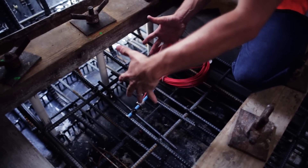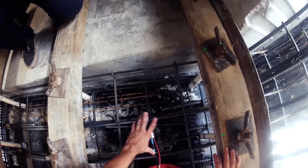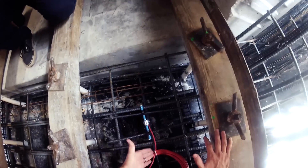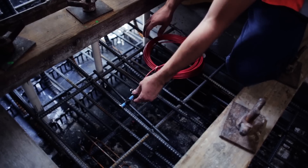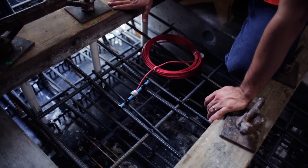I think this technique is more useful because you can actually know the shrinkage and the creep within the structure. So as the concrete shrinks or creeps, it'll push in on the sensors here on the end, compress it, and it'll get conducted through the cable, and it'll measure the change in strain in the concrete itself.